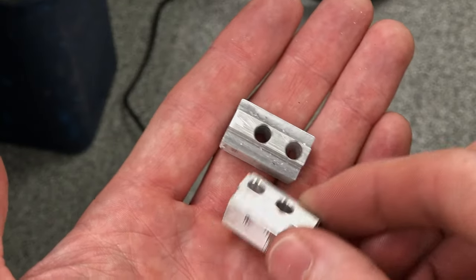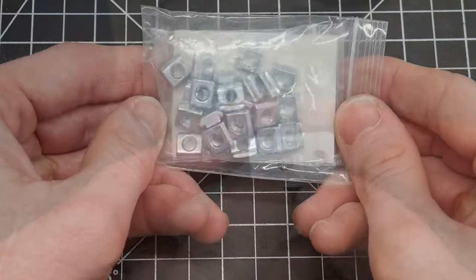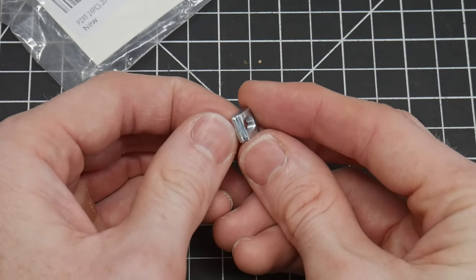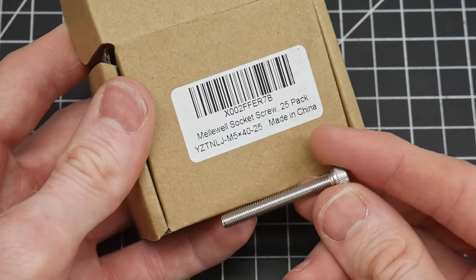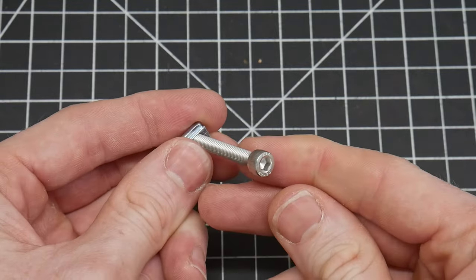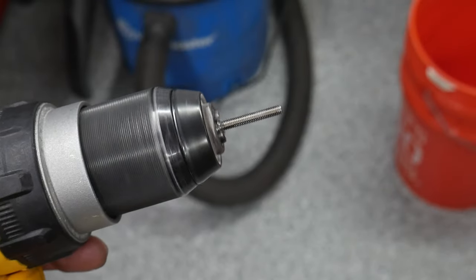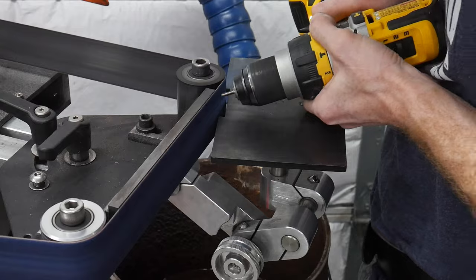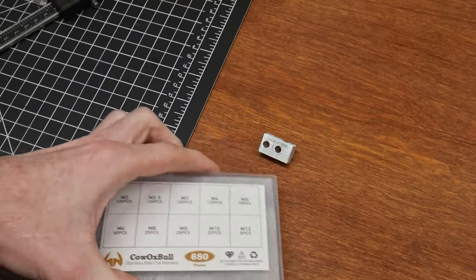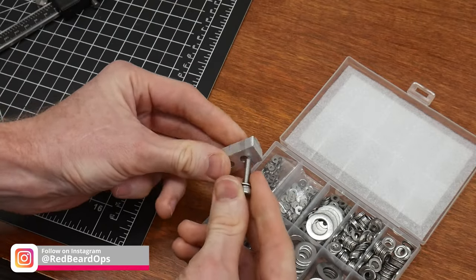I came back and added a second hole to allow for more clamping area on the traveling stops, since the table screws have the potential to apply a significant amount of force to these blocks. I was able to find a set of t-nuts on Amazon that just happened to fit the 3990 rail. I also ordered some stainless steel M4 and M5 cap head fasteners along with an assortment of metric washers. I'll put affiliate product links in the description. These fasteners are too long and were purchased with the intention of modifying their length — the target length of the M5 screw will be 20 millimeters and the M4 screw will be 12.39 millimeters.